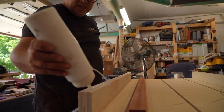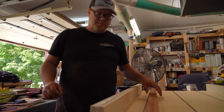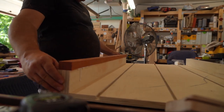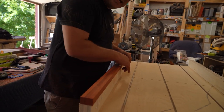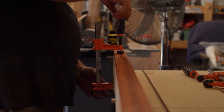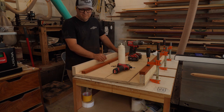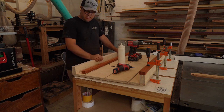Because I'm going to route into the top of this I can't use screws, so we're going to use some speed set and clamp. I'm going to let it overhang a little bit on this side because I can flush trim that and it'll be perfect. The back rail can have all the screws you want, just as long as they don't ever get anywhere near the blade — so we're going to drop some screws in there along with the glue.